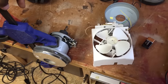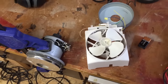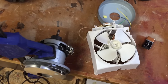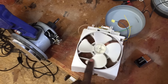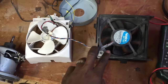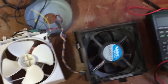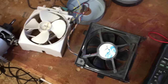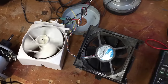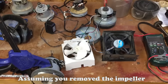When I was building my scroll saw, this motor would get really hot — dangerously hot; it was actually smoking, and I showed that at the end of the previous video. To alleviate the overheating problem I installed a fan right behind it just to blow cool air over it. This one comes out of a microwave, but any kind of fan would work. I also have one from an old computer that puts out a nice concentration of air. You don't really have to purchase one — a lot of things are thrown away because their primary function doesn't work but still have working components inside. You're definitely going to need a fan if you're going to use a vacuum motor in your machines to keep it cool.